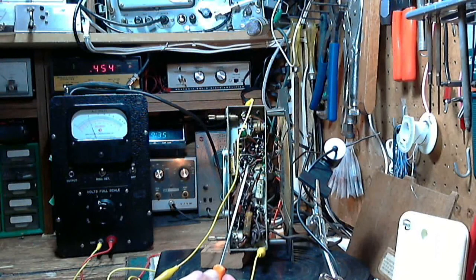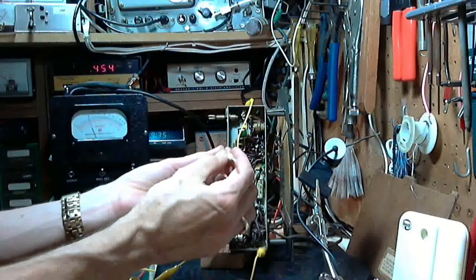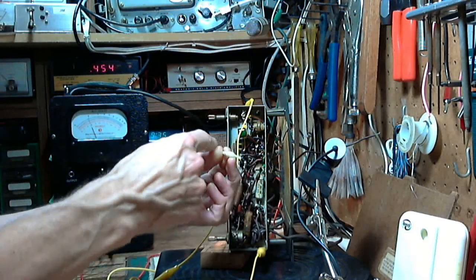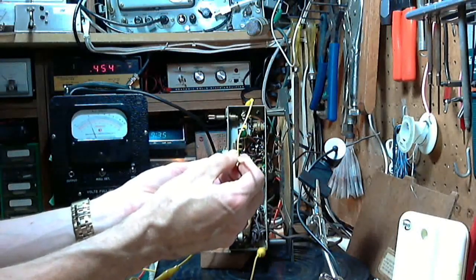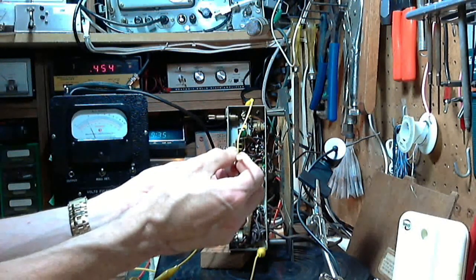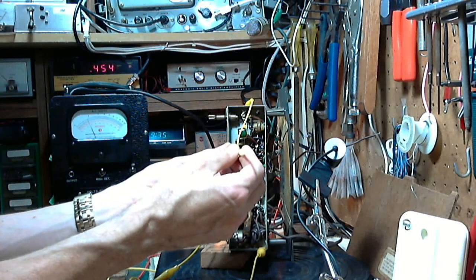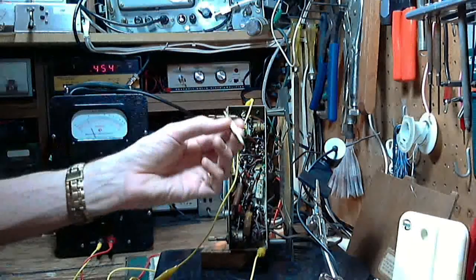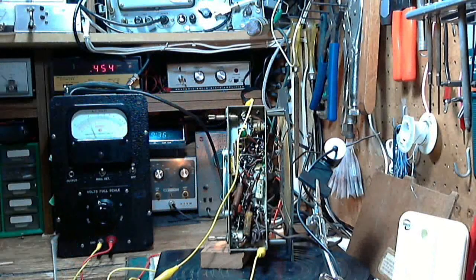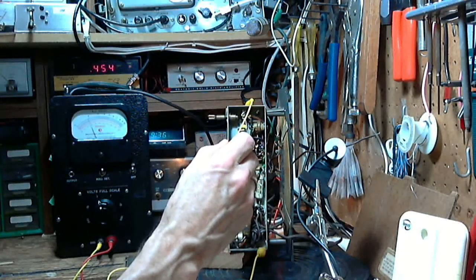The reason I use metal is because of the rigidity of the shaft. You use plastic and you slide it into the slot of the screw. You then begin to load the driver up before the screw turns. You'll put a twist in the plastic and load it, and then the screw will start to move, it'll pop. And then you try it the other way, and you turn it, the screw won't turn. You load up the tool, and pop, the screw jumps back, because of the springiness of this tool. You use a metal one, it doesn't happen. But with a metal one, of course, I could short something out here. Maybe I had to keep my eyes peeled.